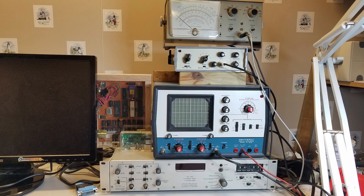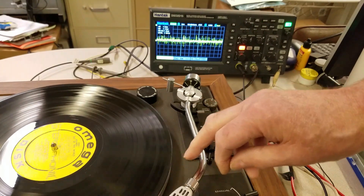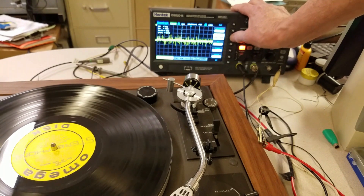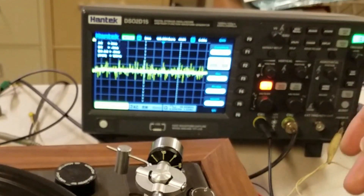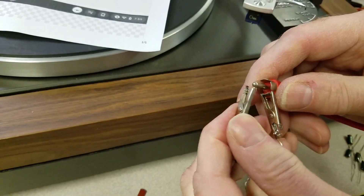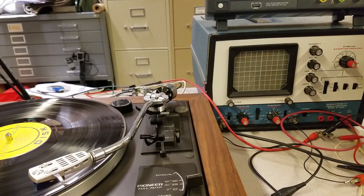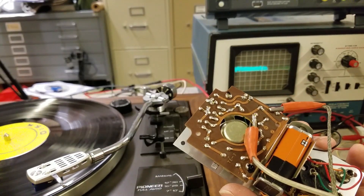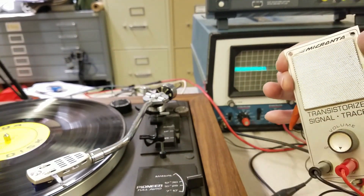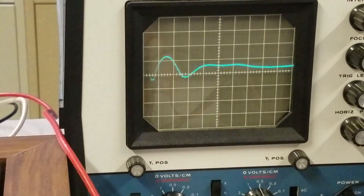I'd already separated the turntable from the rest of the system without a preamp. The signal level from the magnetic cartridge was very low. I'll just crank up the gain on my digital scope. However, with probably 20 switch mode power supplies running in my shop, the RF noise was incredible — it completely overwhelmed the rumble. So I built a little low-pass filter, which helped a bit, but not enough. My digital scope was too fast, so it was time to break out the old school stuff. My trusty Heathkit scope was slow enough, but didn't have the gain I needed for the low-level signal. So I hooked up the signal tracer to amplify the output of the magnetic stylus. I finally got the signal, but I had to slow down the sweep to try to capture it. Of course, a slow sweep on a CRT scope results in faint fleeting traces. Through the magic of video editing, here is the result.